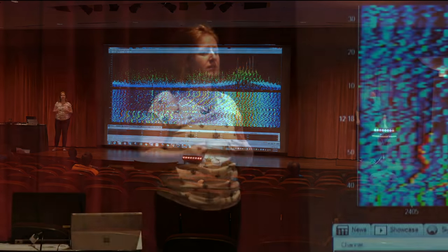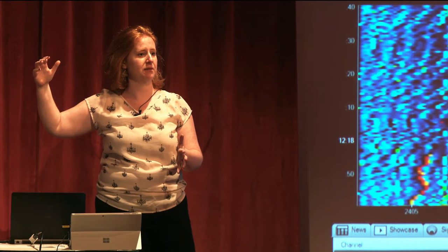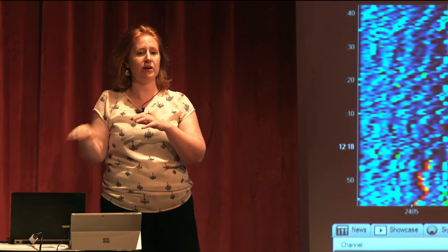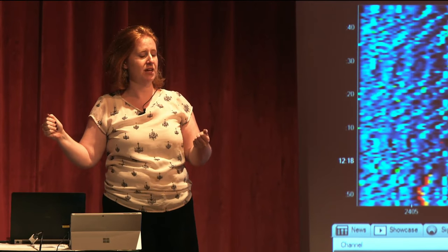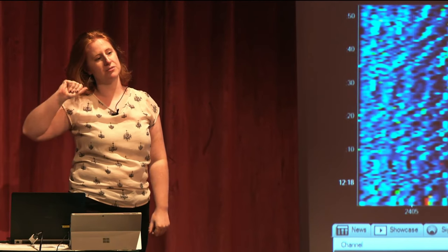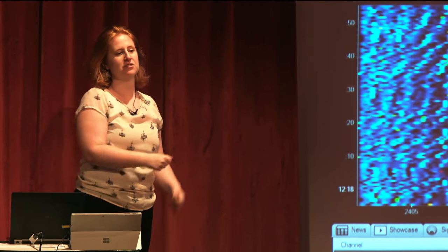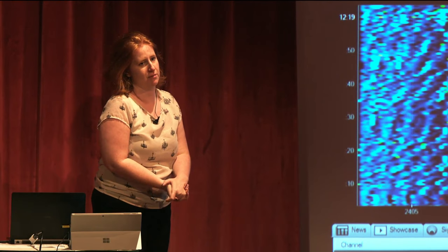And so we thought, you know what, let's put a little backup rig behind where our normal lighting positions are for this event. We put wireless receivers on both of those and set them to the same receiver ID. And because I knew it was going to get knocked out, when that first one got knocked out, we put power to the other receiver. The second it turned on, it immediately was in touch with the console. It was up to date. It was receiving DMX fine. So it's a really immediate response that you get from it.